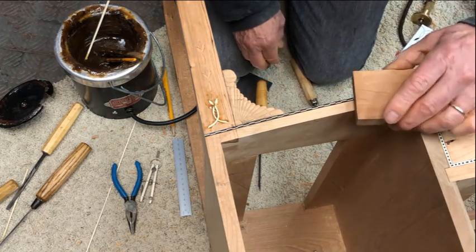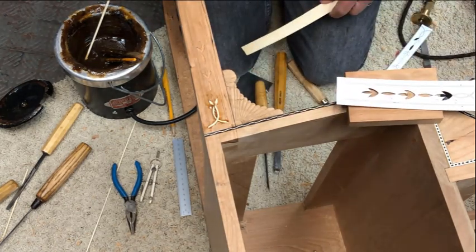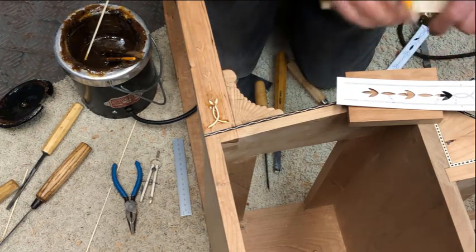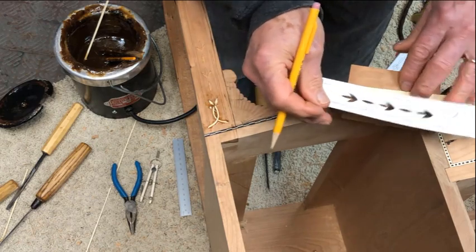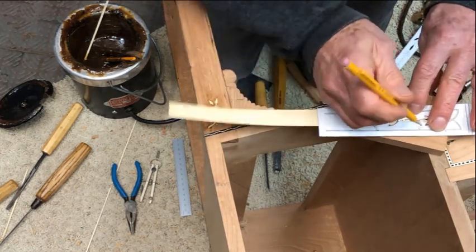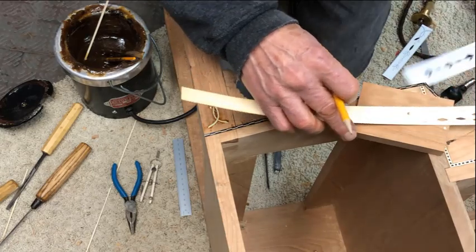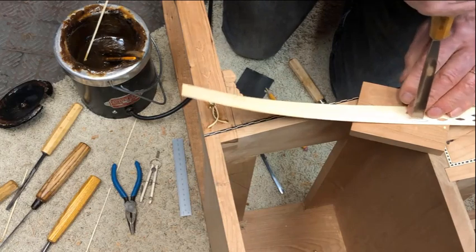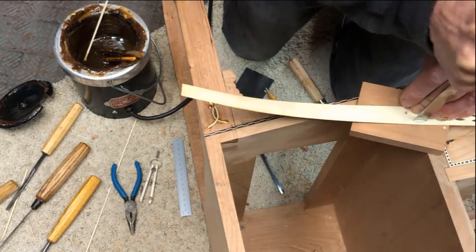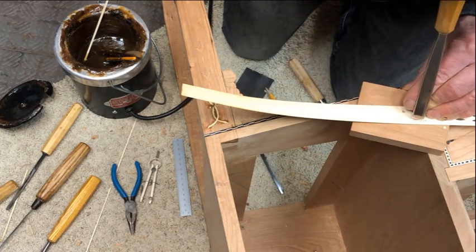But there are other long petals that go into this thing. And there's the shape of those longer petals. I just trace the shape on this 1/16 inch sheet of holly. And then with a number 5, I think it's a 12 millimeter number 5 carving tool, I can match the shape with two punches for each side.